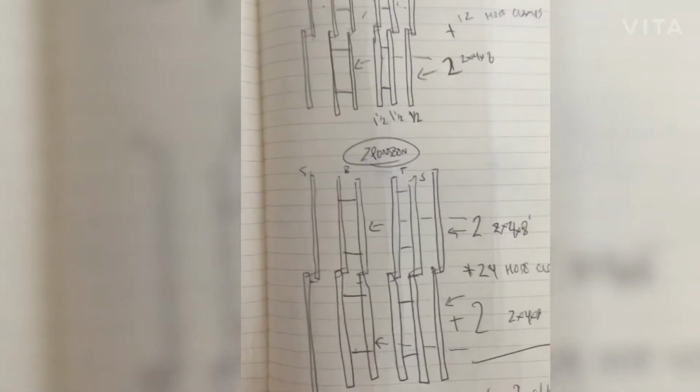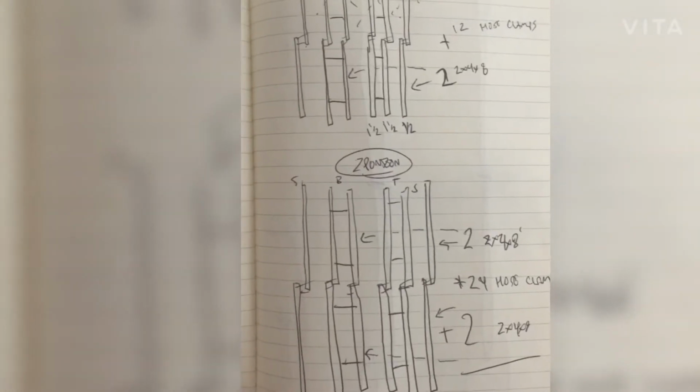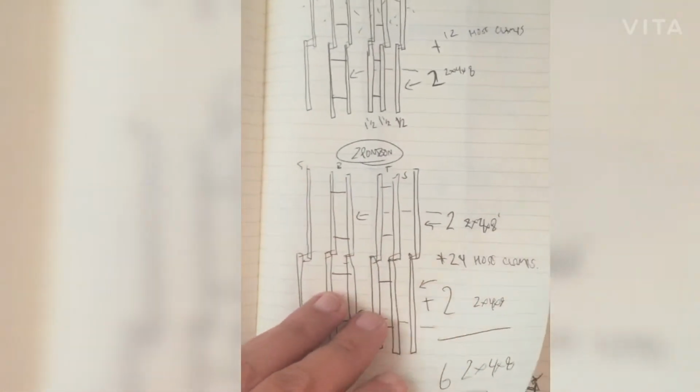Here is the slat rail design for the pontoons. Notice each pontoon is going to be 15 feet long. It's two 8-foot pieces of wood joined with a foot overlap, so you lose a foot total and you have a 15-foot beam when you join it.